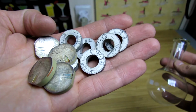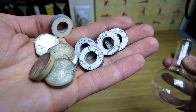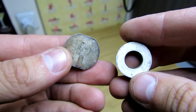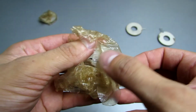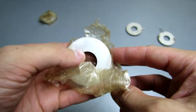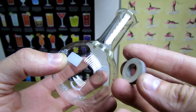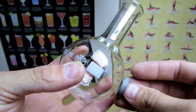On the market, piezoceramics vary in size and shape. The ideal option was a solid washer without any holes, with a diameter of 22 mm and a thickness of 4 mm. During the experiments, a large piezoceramic with a diameter of 50 mm and a thickness of 6.5 mm was tested. The next step in creating an acoustic chamber is the connection of the piezoceramics with the flask.